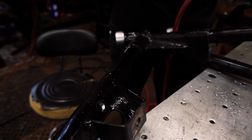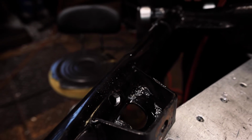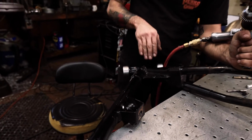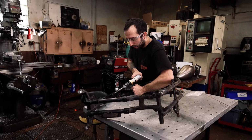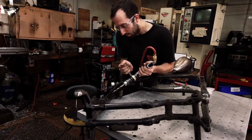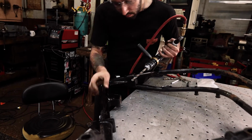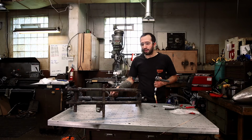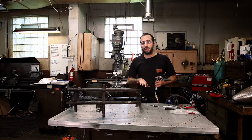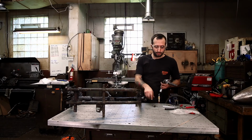And so now you're almost using your drill as an end mill to cut away and cut a little bit of an angle to make that transition a little smoother for your wiring. I think I might put a little bit more on this. Okay. The next thing you're going to have to do is get a straight little air grinder and get in there and clean up the burrs really nice, because the last thing you want is any kind of little sharp metal slivers to be able to stab your wiring.